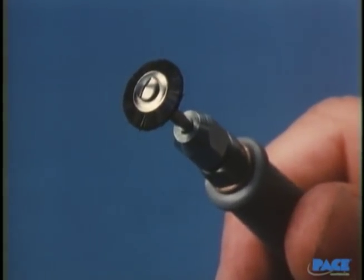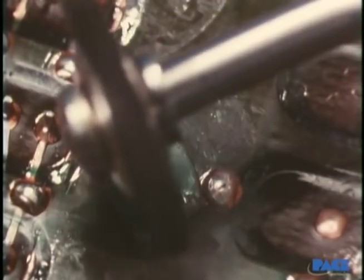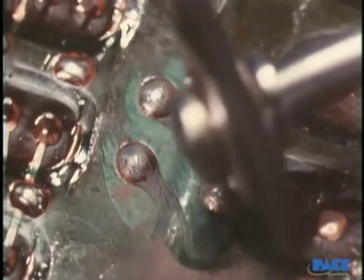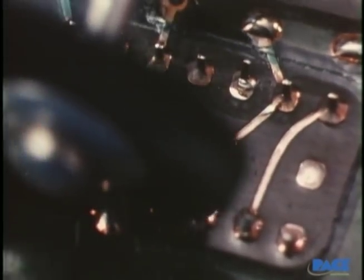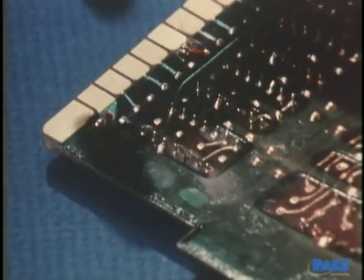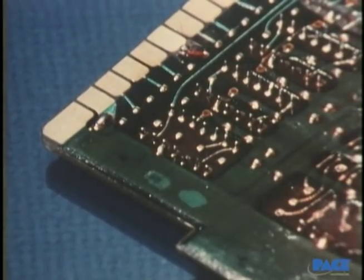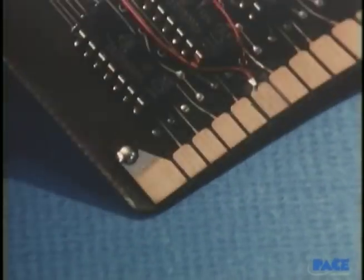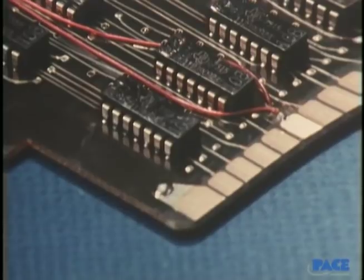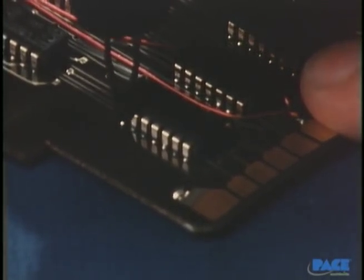A bristle brush is then used to complete the removal, since it will conform more closely to the contoured surfaces. The brush is also the best choice for soft, thin coatings — at low speed it doesn't clog up like an abrasive wheel does. The final step is always a thorough solvent cleaning prior to desoldering. And then, around each of the leads on the component side, the seal needs to be broken to provide an air passage for vacuum desoldering. Here it's being done with a thermal parting tip; you could also use a bristle brush to do it.